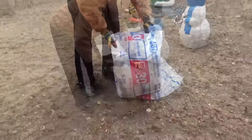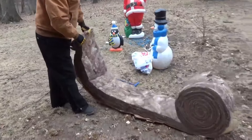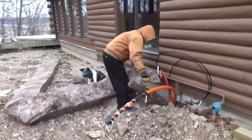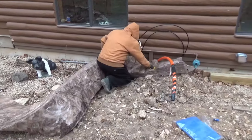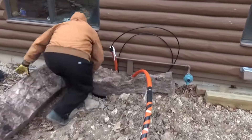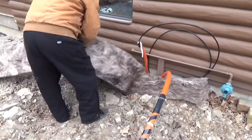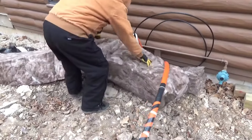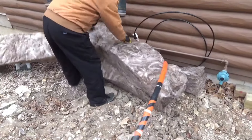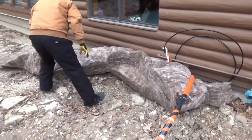The trick to get that frost out of there is to take some insulation, unroll it, and lay it evenly over the ground. I've used this trick for many years to take frost out and do work around the house — in fact to bury some farm animals. For the cost of a roll of insulation it works very well. No heat has to be applied; it's just going to use the ground heat.